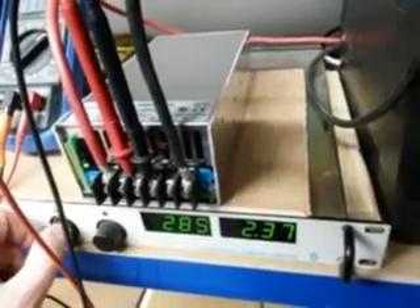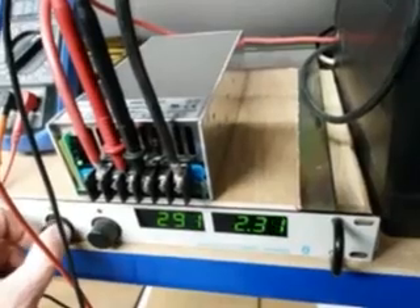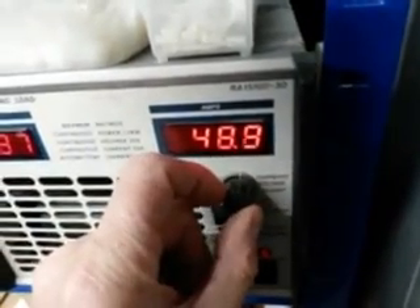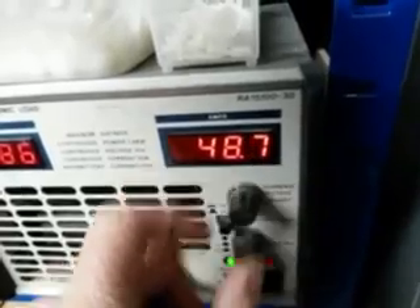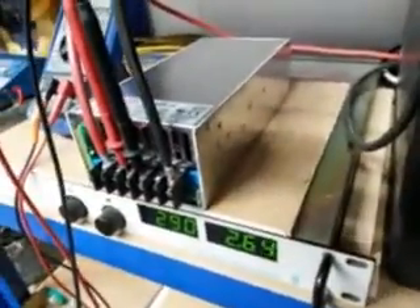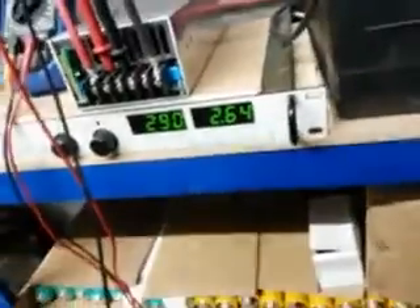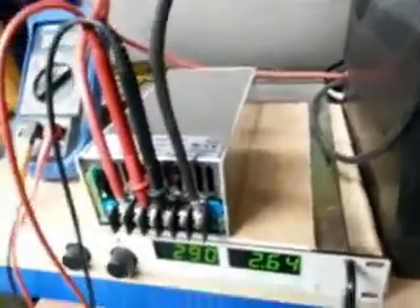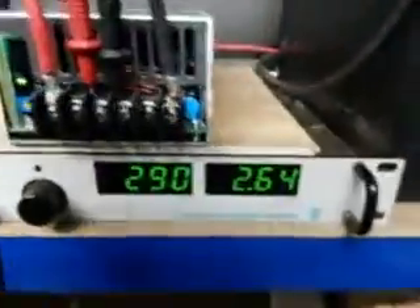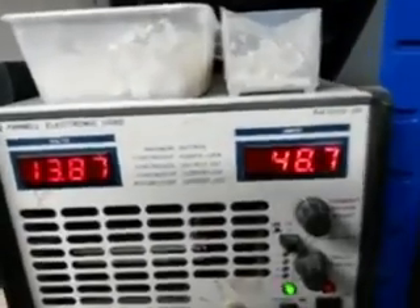Just remember this supply is designed for use on 240 volts AC, which will easily give over 300 volts DC. I'll turn it up to 290 volts — we're still getting 43 amps. I'll crank up the current again to see if it'll go above 49, but 48 amps is about this supply's maximum. It's chucking out 48 amps at 290 volts input and its case is not warm to the touch. It's pulling 290 volts at 2.64 amps and outputting 13.8 volts at 48.7 amps.